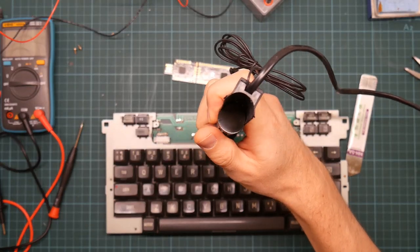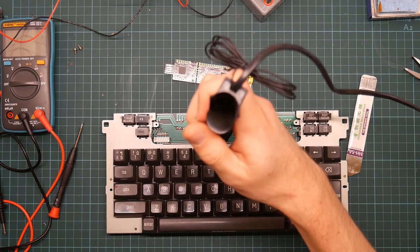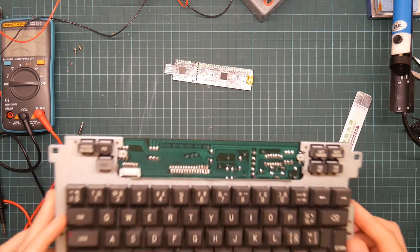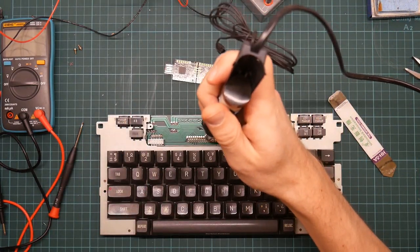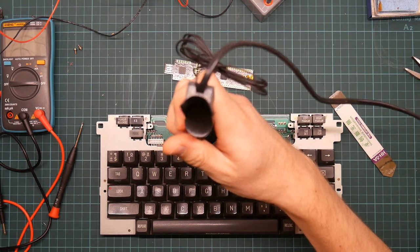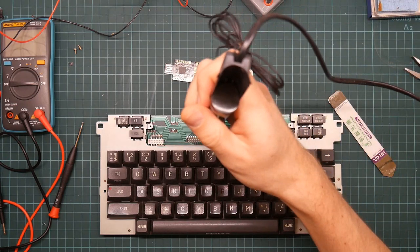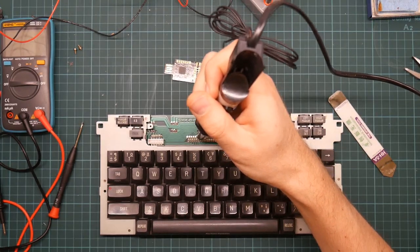The professional ones, or at least the less unprofessional ones, have a powered sucker. So you just stick the thing on and it sucks all the solder out into a reservoir. Has that done anything? That is actually removing the solder reasonably well, which is awesome. So hopefully I do the rest and then it just comes off. I think this cost me about 3 francs, with all the electrical safety that price tag implies. And yes, I did check that it works with 240 volts.